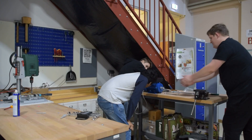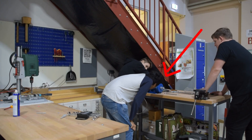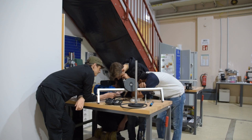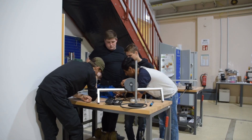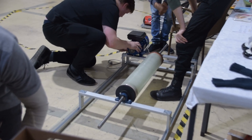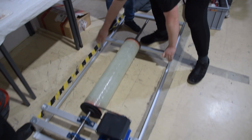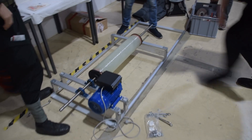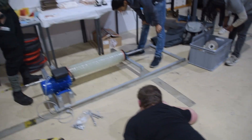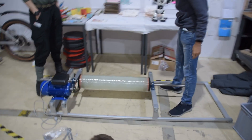So in order to get more rotation, we basically just needed a bigger motor. With the switch to more power, you also need more structure — bigger adapters and gears to transmit the force from the motor to the tube in a controlled way. The solution was to use a belt drive with a 1-to-3 ratio, giving us 3,000 RPM on the motor and 1,000 RPM on the tube.